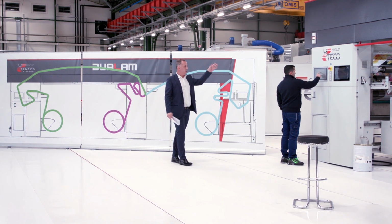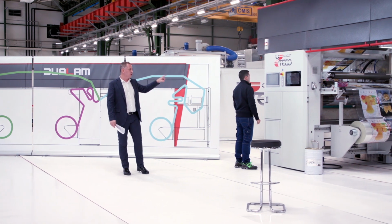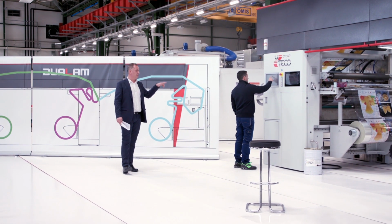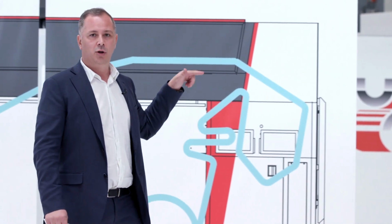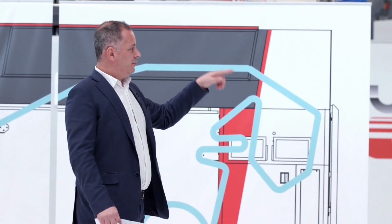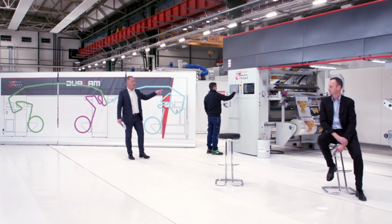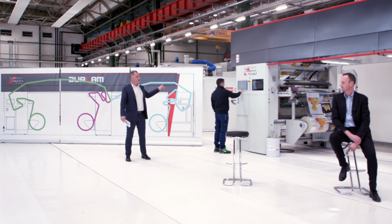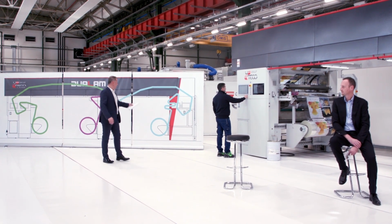This is a solventless unit where we have the two steel rollers where we dose the adhesive. We have a rubber roller for transfers, and we have an easy sleeve mechanism which is easy to change. It is extremely fast in job changes. We have another steel roller where the primary film arrives, and we place the coating and adhesive.